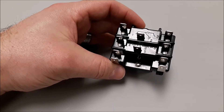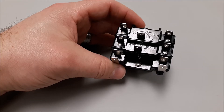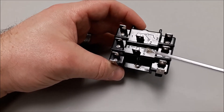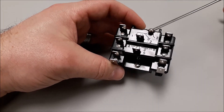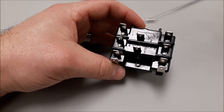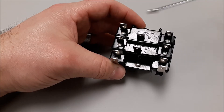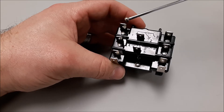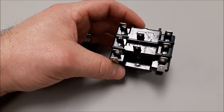On the top of this 90-340 relay, I've already gone through terminals 1, 2, and 3, but there is an identical sister set of switches: terminals 4, 5, and 6. It is the same layout as the first set of switches and acts at the same time, but it is a completely separate circuit — so I could run two different loads through here at different voltages if needed.